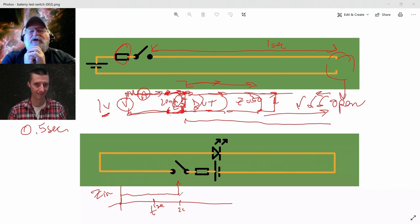If I have an ohmmeter that's really slow, that takes half a second to work, I have to have a transmission line with at least a half second time delay in order for me to see the resistance of the front end with my slow ohmmeter. The shorter I make that cable, the shorter time I have to measure that constant input impedance or resistance.